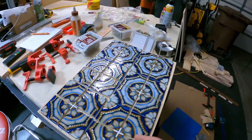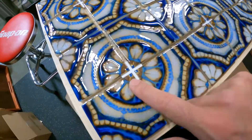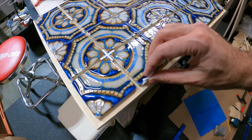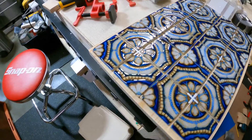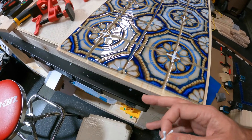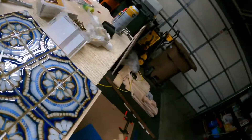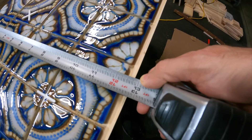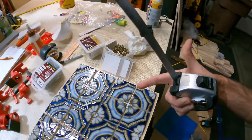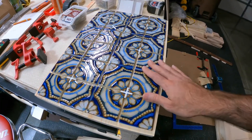I'm going to do a little bit different design on this one — I'm going to do a miter. I got this cut down to size and laid out the tile. I'm using a spacer on the edge, and I'm going to leave a little bit of an overhang so I can put a groove into the side piece and slip that groove onto the edge. The dimensions for this serving tray are about 12 and 7/8 inches by 18 and 5/8 inches — roughly 13 by 18. Pretty nice tile; I think it's going to look good with that birch.